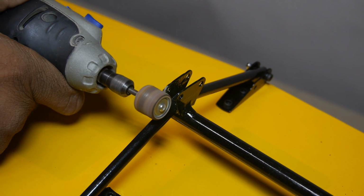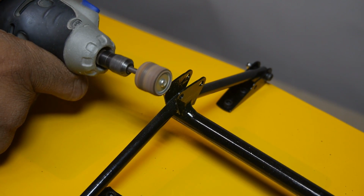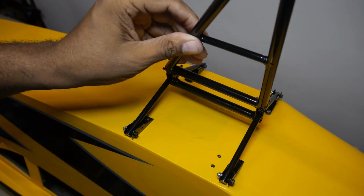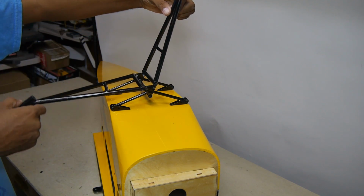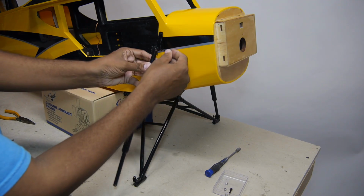It turns out the A-arm weld joint was interfering slightly at the corner, so I ground a little off the bracket. That did the trick quite nicely. Movement is smooth and easy. Now to install the side mounts for the shock struts.